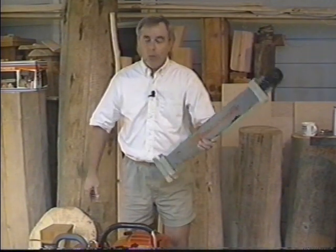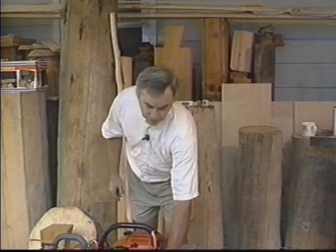and if it's rounded, you can literally hollow grind that flat, which may give you a lot better seat for mating surfaces. So what you gain with the flat bar, as far as having a flat face, may be offset by the fact that you may intentionally want to put some shallowness in there and actually gouge that out for a better seat, a more weather-tight seal, should we say, in the log home business.